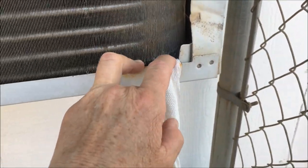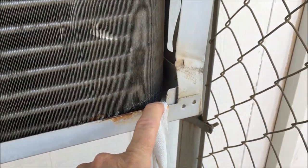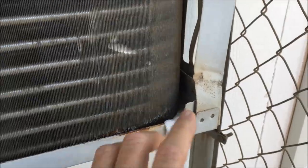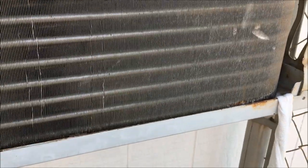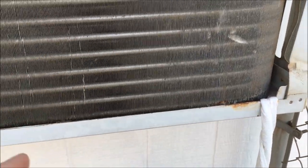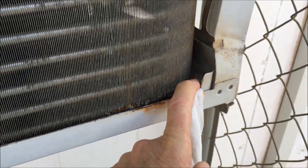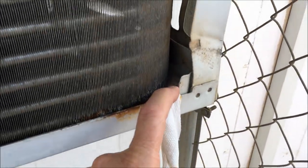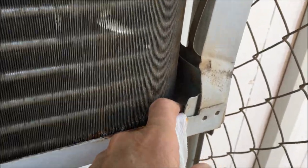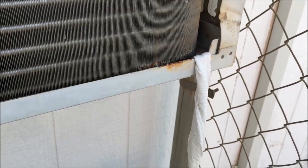Here's what I do. I use one wick, and the reason is this: I'm not sure whether it's a good idea or a bad idea to have the water standing while it's operating. So in order to go with what the manufacturer recommends, I leave the water in there when it's operating, because this paper towel wicks out at such a slow rate that the water remains collected in the bottom of the pan, doing its job of energy efficiency — splashing the water up onto the condenser coils.